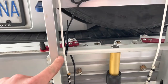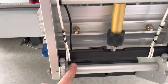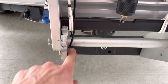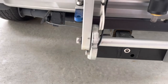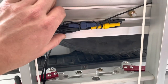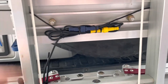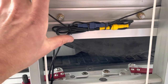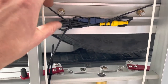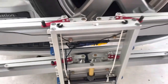So I decided to run this underneath — that way it stays away from all that and won't catch or pinch. The path is: through the platform, over the aluminum center bar held by the zip strap, and over the black bar underneath the silver pivot, then to the plug. You can make this as long as you want by bundling the wires and using zip straps. Eventually I'll get some loom to wrap it up a bit cleaner, but it's totally functional.